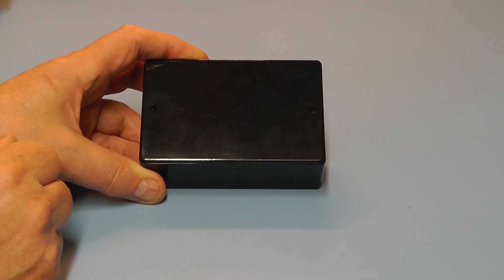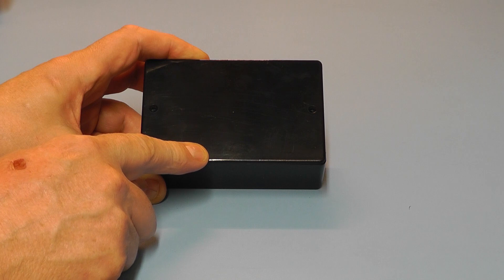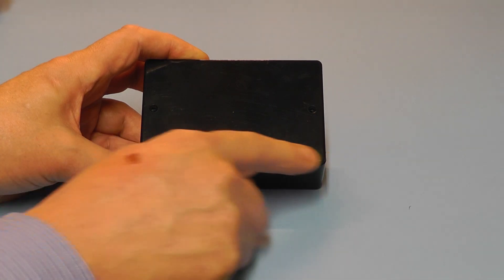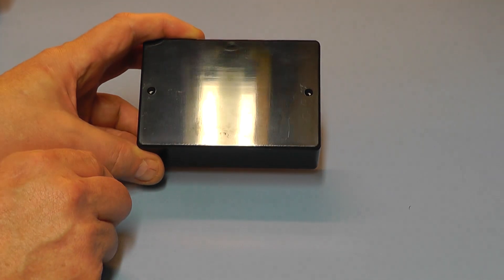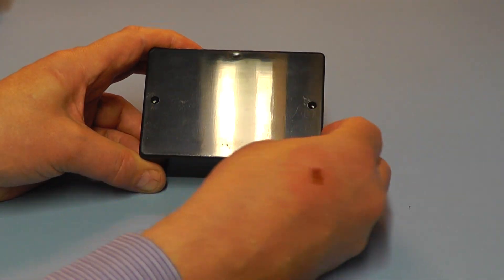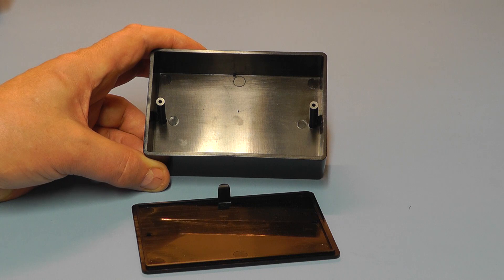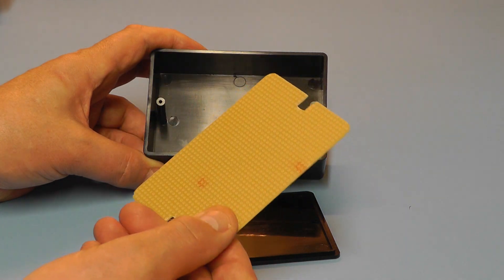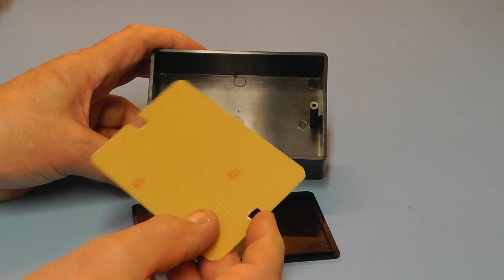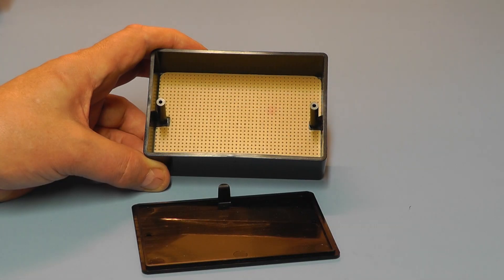What I decided to use for this project was a small plastic box which is around 75mm by 111mm approximately and about 40mm deep, but any sort of box of reasonable size like this would be more than suitable. As this is a one-off project I also decided to use some perforated board rather than make a special printed circuit board. I have cut myself a piece of this through-hole board, and also cut out the sides so it slots over and fits into the box.